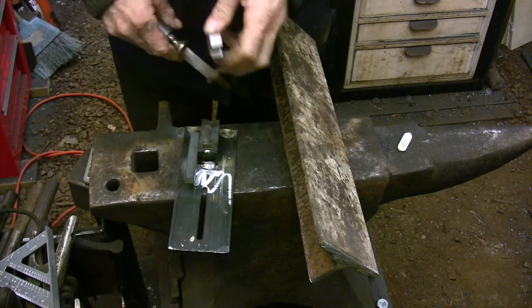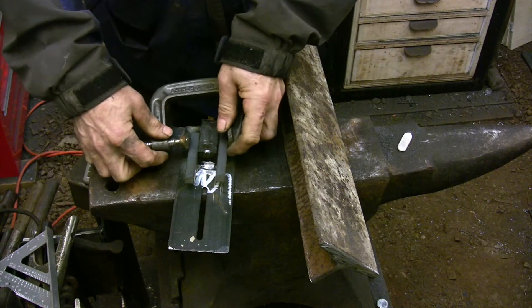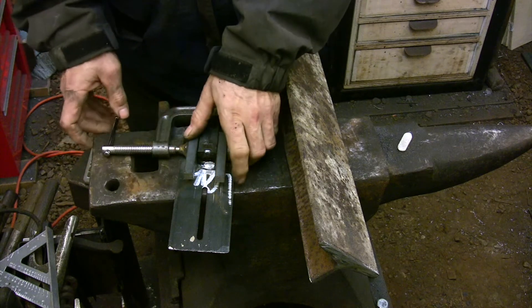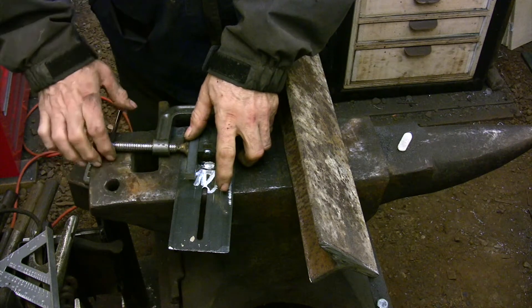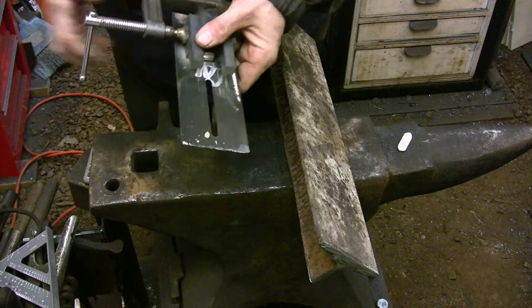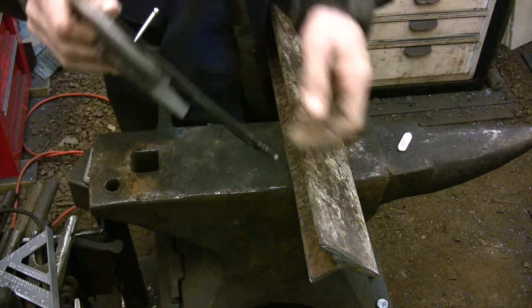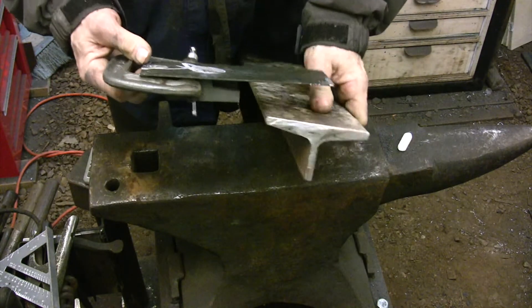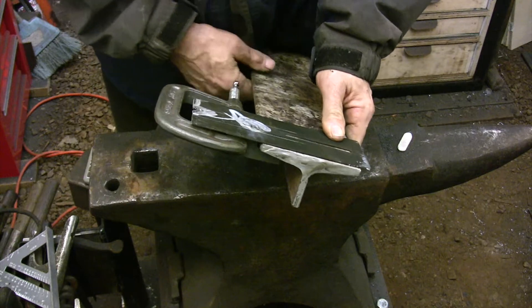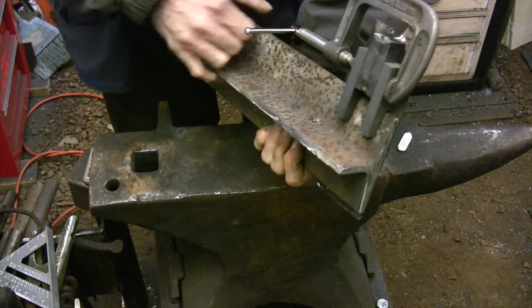The jig is just a one inch bar that's welded to a piece of flat bar. The flat bar can be any size, but the spacer needs to be welded directly in the middle of that flat bar and it has to be parallel to the sides. Once the horns get clamped to the spacer bar, the whole thing just fits over the beam and gets clamped into place.